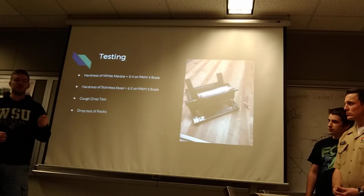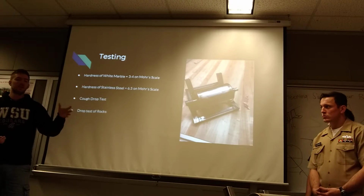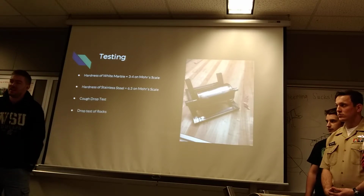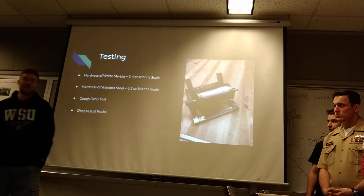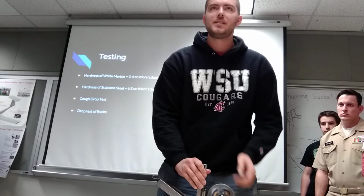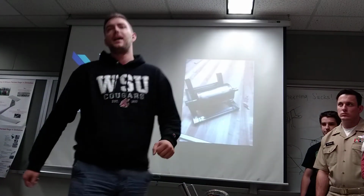Our other unknown was, do we actually need teeth? Because adding teeth to our barrel is going to make it a lot more difficult. So we did something we named the cough drop test. If you look over there, you can walk by it as you leave class today, is a broken up cough drop. And that did not go easily. We dropped a cough drop right in through our plate and our barrel, and we started spinning this, and it would not go down. Instead, it would just spin there or not go anywhere. So Emma was kind enough to take a ruler and just jam it down, and it became powder.